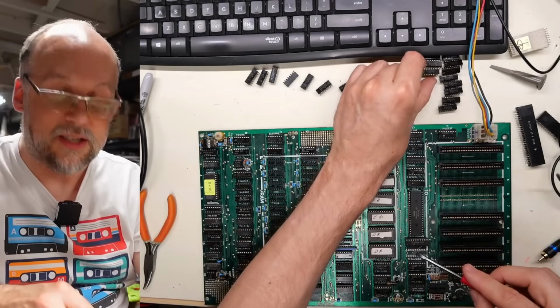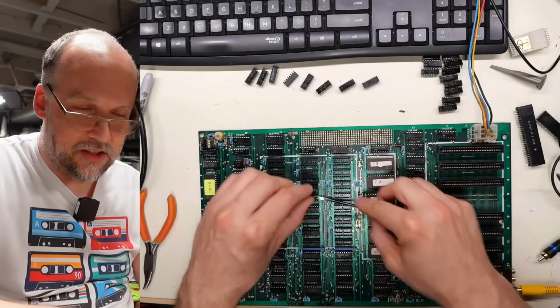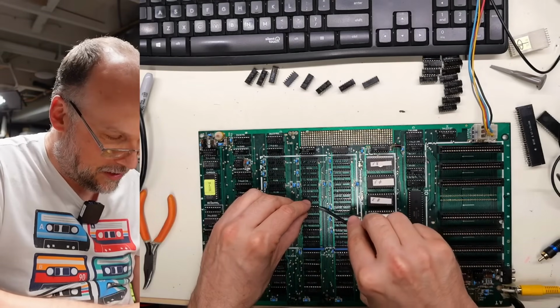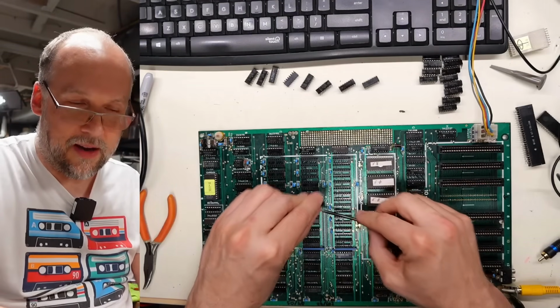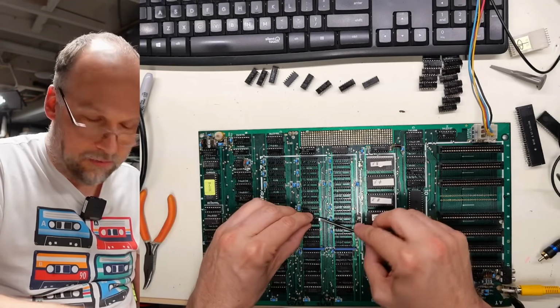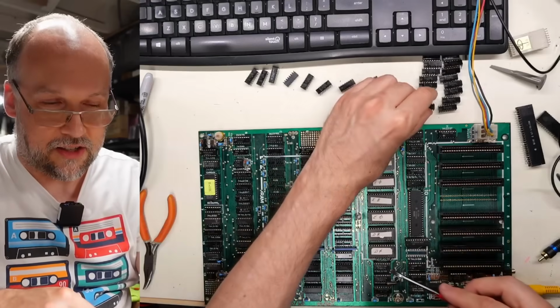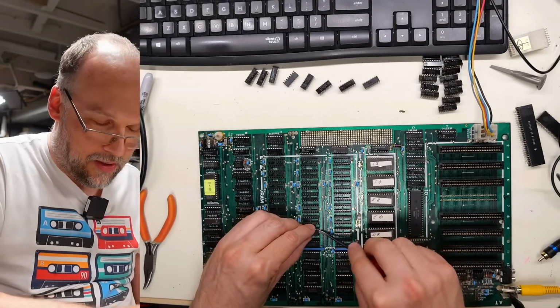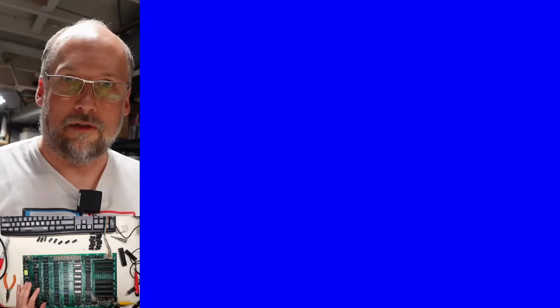And since the RAM is all paralleled up, that means that any of these other chips that are misbehaving in these other sockets up here can affect that first bank. And you need the first bank to be working, because that's the 0 page, and the 6502 doesn't really work properly without 0 page. It's necessary for the stack and all that stuff. The ROM is not really gonna do much without any 0 page. I'm gonna grab some tested memory and we'll try it with that.